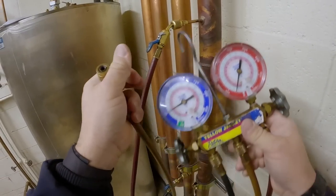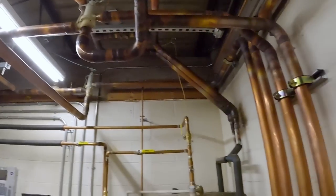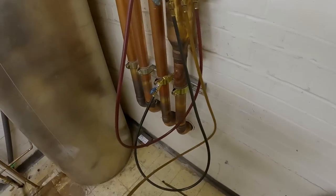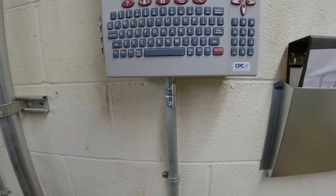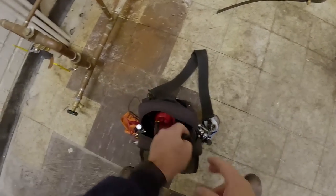There's definitely a lot of vapor going down way out there to the air handler. I'm going to check the suction — suction's running at 47, so it's not going to do much. We'd have to use the recovery machine. Let's go look at the receiver level and make sure it's still up.